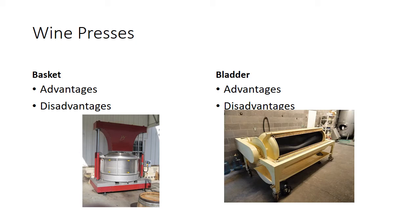Bladder presses are super powerful — probably the most powerful of all the presses. You can press the guts out of the wine and put more pressure on them than anything else. They're designed to crush cranberries as well as grapes. The disadvantages are that the rubber bladder will pop in the middle of vintage — which is normal — and they're pretty old school with no safety equipment and totally manual, very analog. In this digital age, you've got to have an operator standing there all day turning it on and off, which is expensive. Something that archaic and lacking in safety is pretty terrifying to have on your crush pad.